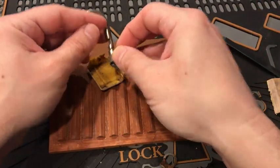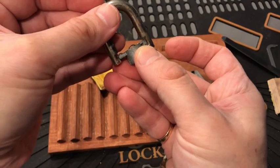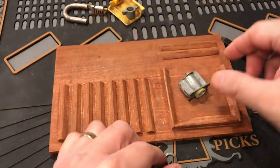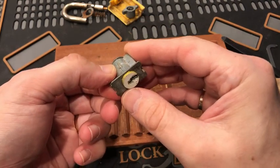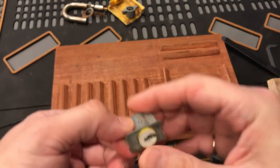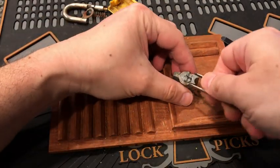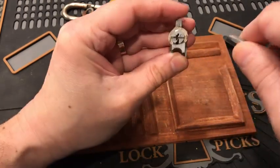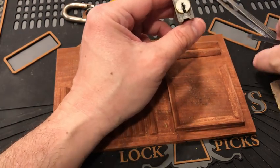This actuator literally just sort of catches in that piece over there. So yeah, the actuator just sort of rotates to fill those two holes. Again, it's not exactly your highest security lock. Let's see what sort of stuff they put inside these things. This one needs to be picked in order to get it the rest of the way guttable, so let's start by pulling off the C-clip — pick it first.